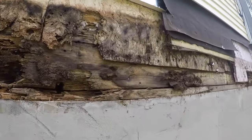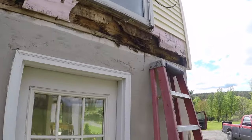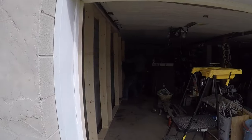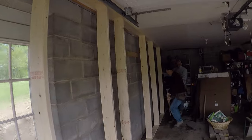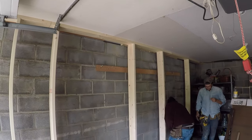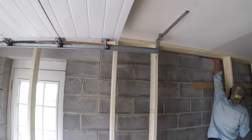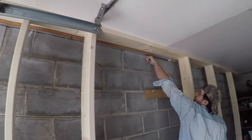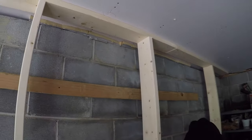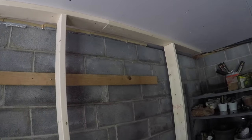On this side of the wall we've got Eddie and Connor and they're jacking a wall up — they're actually going to build an inside wall to support the house while we throw out that junk on the other side of the wall and replace it with some new fresh lumber. We're going to use treated lumber over there. Just the sill contacting the concrete will have to be treated, and it's all going to be treated so we're not going to let this happen again.